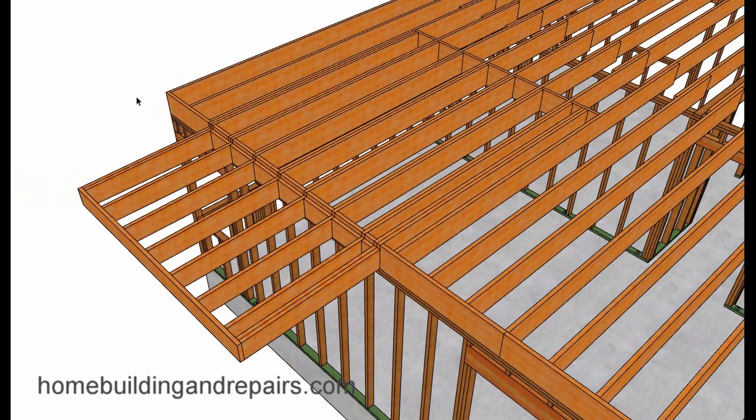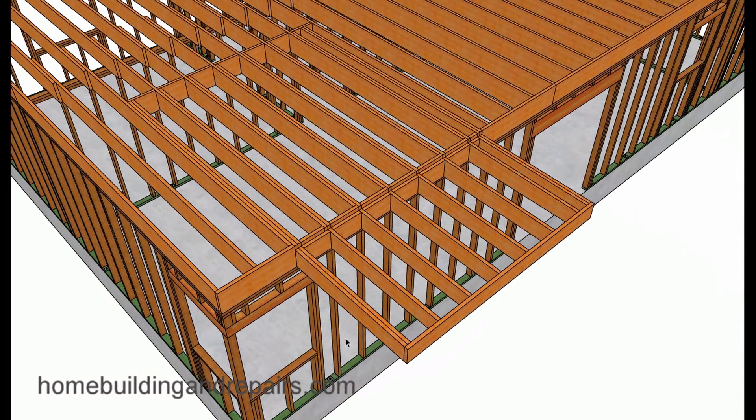In example two we will be using smaller joists — 16-foot joists, with a five-foot cantilever again. This time we are going to have double joists around the edge. I have seen them where they put double joists all the way around. It is five feet sticking out and going back at least ten feet. Since they are 16-footers, they are going back at least eleven feet, which will make the engineers happier.